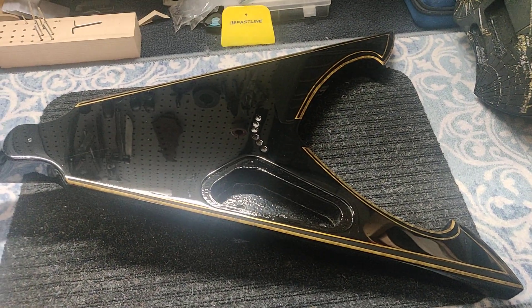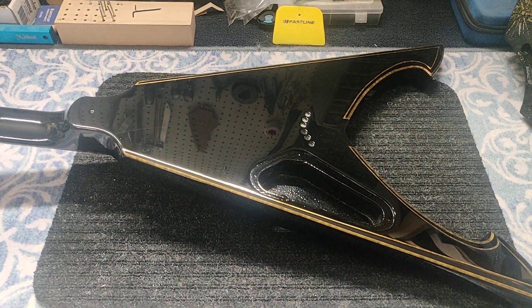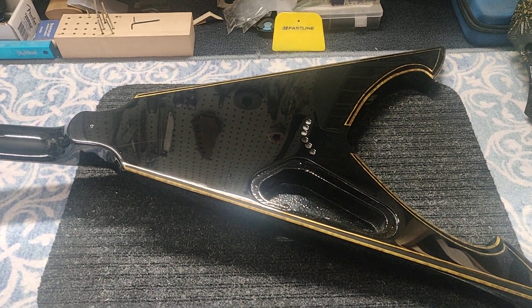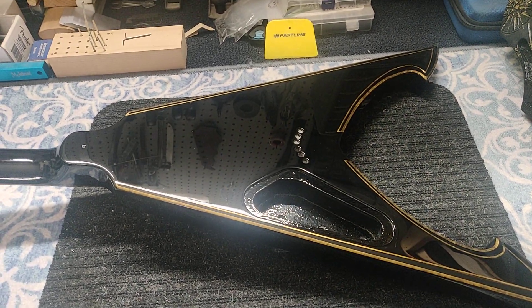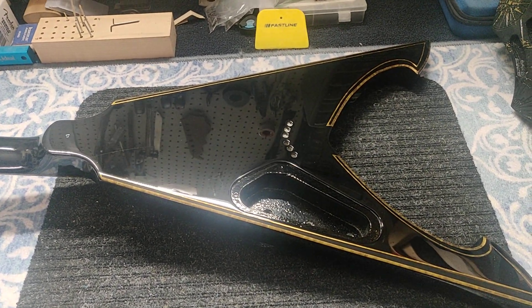There are these white little tiny things and you never see them until you go to buff it. Your final wet sand and buff is when they show up. Sometimes you can sand them out and sometimes you can't. So we had a couple of issues with solvent pop — even though you clear coat the guitar and it looks absolutely perfect, when you go back and flatten it out, wet sand and buff, then you see the unfortunate solvent pop.